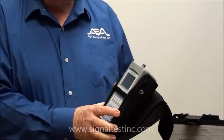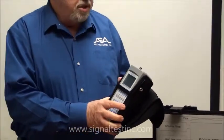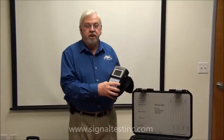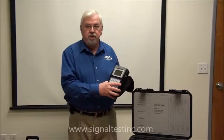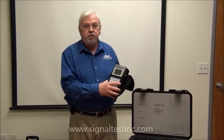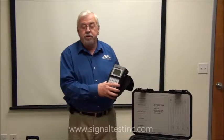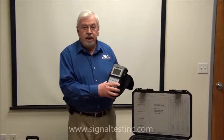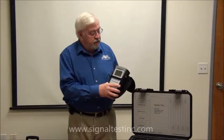And one of the big advantages on board aircraft, when testing the single wires in a harness, is any two single wires in that harness can be picked out and measured despite the impedance variations across the harness. We can provide you an extremely accurate picture of the connectors and the length of the cable and absolutely any faults that are in the cable.